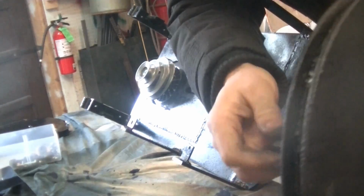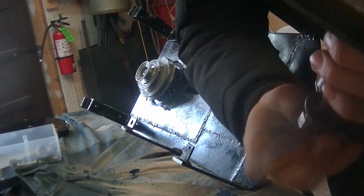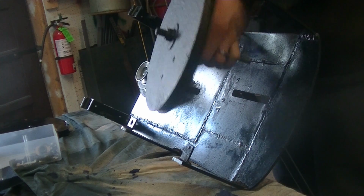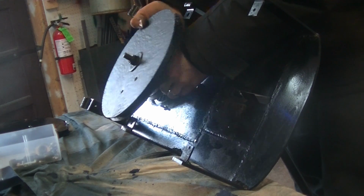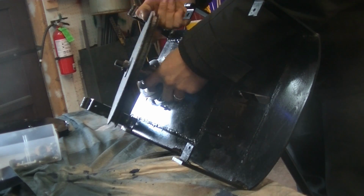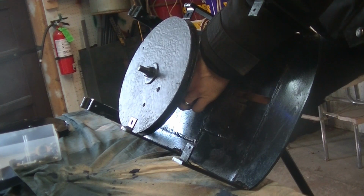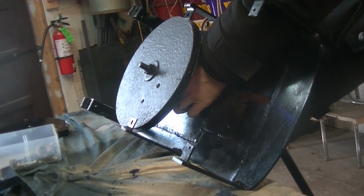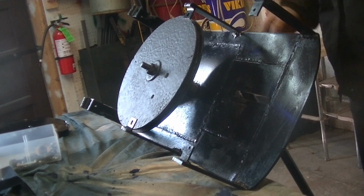So we're going to take this nut off, and then we're going to pass it through this first slot next to the motor. Now there's a certain amount of adjustment, and the adjustment needs to be set when we have the other half on, the business end with the propane tank. So we're gonna get this in there. There we go. And then we're gonna put the washer and the nut on the back end here and thread that down. Now, just finger tight for right now.